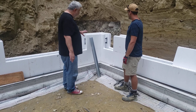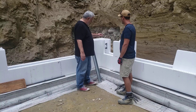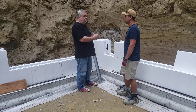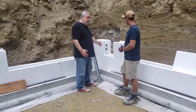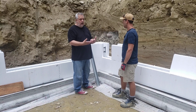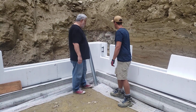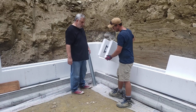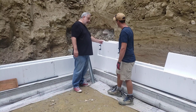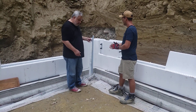All these corners have either a short leg or a long leg so they can be stitched together and reinforce the corner, avoiding a vertical seam. That overlapping is what allows it to gain its strength. And if you see here, these ribs on the blocks almost slide together perfectly — there's a female recipient and a male part on there.